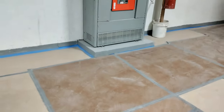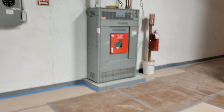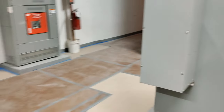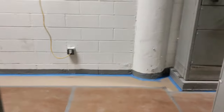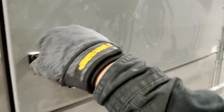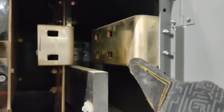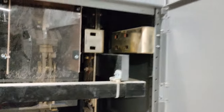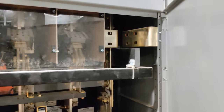If you need it, you can leave it, but be aware: most of these come service-rated so they'll come with it bonded already — ground to neutral will be bonded. So you'll have to take that plate off. This is our ground, grounded to the actual case, and this is our neutral bar. There was a plate connecting the two that we had to remove so it was no longer bonded together, because it was after the first disconnect and we didn't need to bond it anymore.